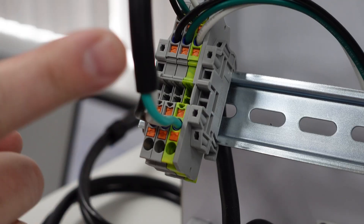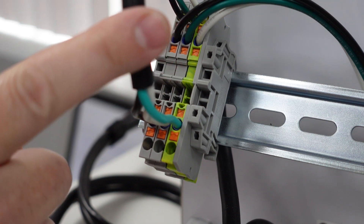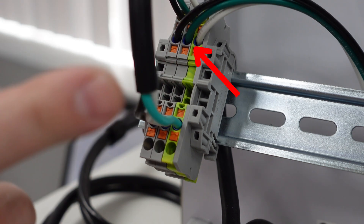That could be an issue especially on older ones, but when I got looking closer at incoming power I noticed when we went to wire to the VFD we swapped the neutral and the ground.